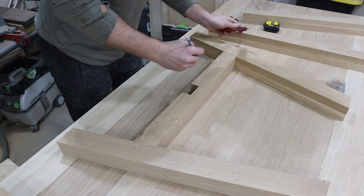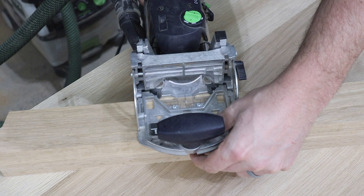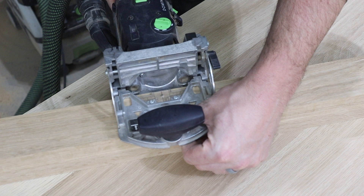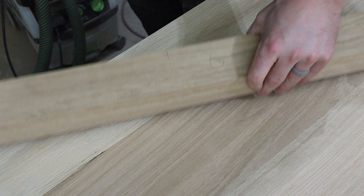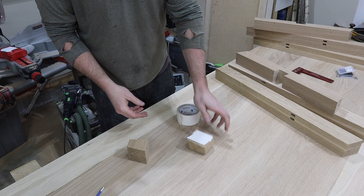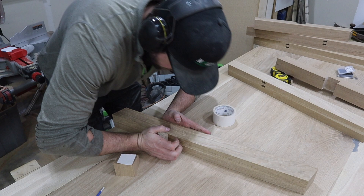You could use dowels for this — maybe just strike a couple of lines and add 4 dowels depending on the size you're going to use. Next, I take the offcuts from earlier and use double-sided carpet tape to tape them back on the outside of the legs. These will make sure that the clamping pressure goes straight across the whole joint. Add a bunch of glue and dominoes and call it a day.